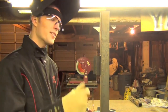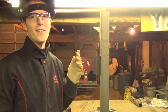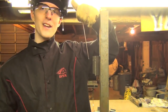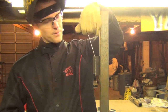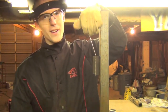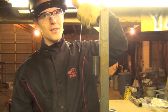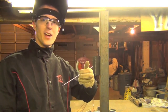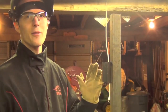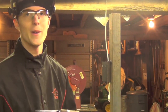I've taken some scrap metal and positioned an inside corner joint on more scrap metal. The first thing we're going to talk about is how to hold the filler rod when you're welding vertically. Rest it further up the joint, hopefully out of the area that's going to become really hot, and simply feed the filler rod as such. Whenever possible, I like to modify the motion I'd use on the table — with your hand resting here, you just feed the filler rod in and put it up above the joint.